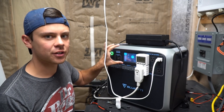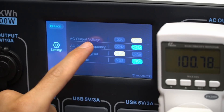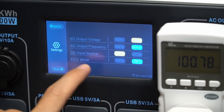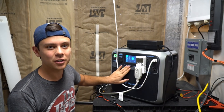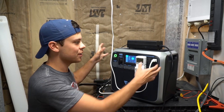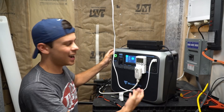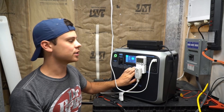Another con was having to change the frequency and output voltage. Be sure to go under settings and ensure the output voltage is 120 and the output frequency is 60 hertz. Also, if you're using solar, select PV mode. I usually like to disable eco mode as well. I'm also not a big fan of these rubber covers — they kind of feel cheap. I know some people like them, but if this is located in an environment where fans are running all day it shouldn't be dusty to begin with. Having dust covers near air vents and cooling systems — I just don't see the point.